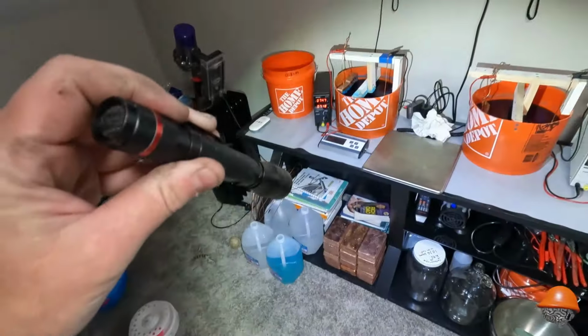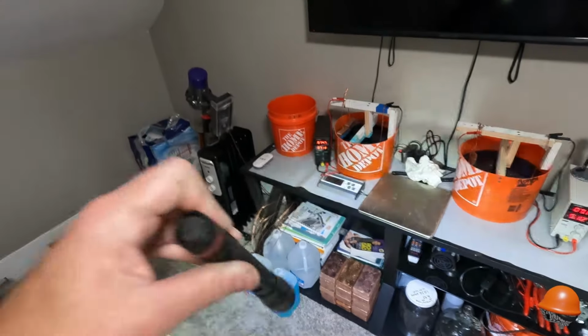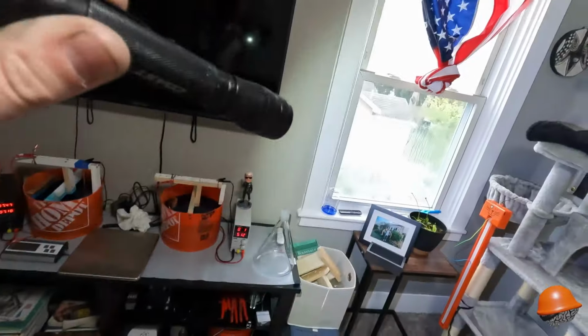But the biggest expense of firing up the forge is getting it hot. So what I think we're going to do is, when we decide to melt some pure copper bars, first, while we heat up the forge, we're going to take the old crucible and melt some of that scrap down in the basement and turn that scrap into impure bars ready to be melted. And then while the forge is hot, we'll throw in the new crucible with the pure copper, and we're going to use the new ingot mold and make some pure copper bullion bars. Real money.